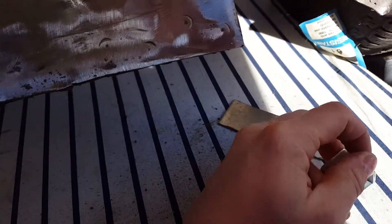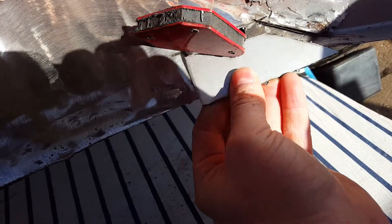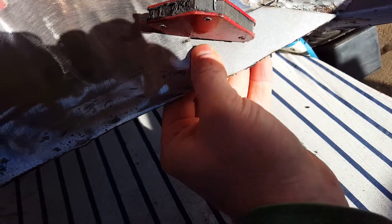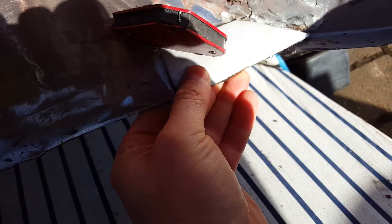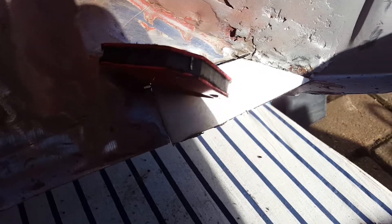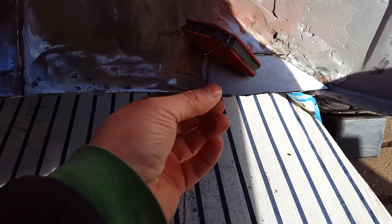Normally this would sit here — you'd loosen this off and it would hold the two pieces of metal together. It's a bit bulky to fit in this joint area, so the preferred method for me is just going to be the magnet. Just make sure you're getting it lined up the way you want it to stay, and you want a gap along here so you can weld and plug it, fusing both bits of metal together. Once I've got a couple of tack welds in here, I can remove the magnet and it will be held in place.